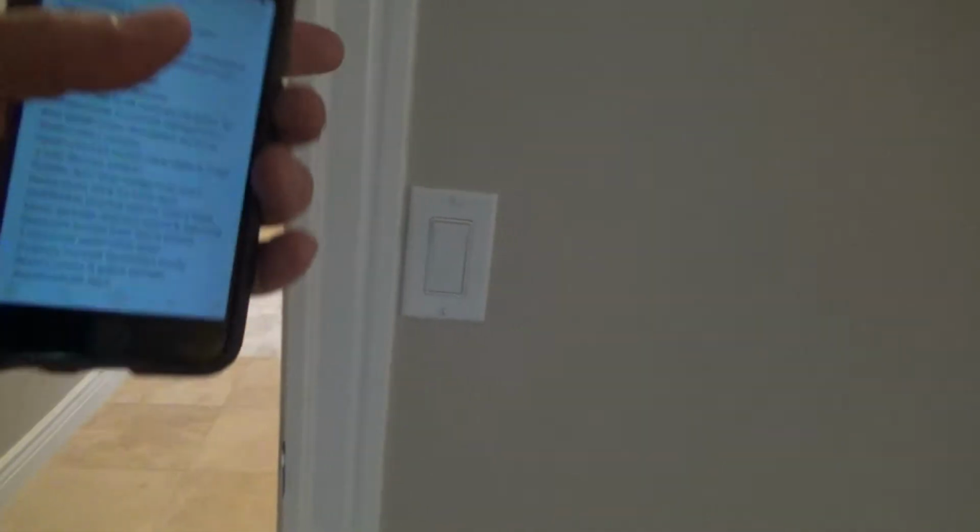Cut it. I take out the light switch, cut out, put a 2-gang light switch in there, put this switch back in there, and I'll probably relocate that over here, and I'll have the switch closest to the door for the new ceiling fan. And so once I cut that out, then I'll be able to fish a wire from there up the wall, drill a hole up in there, and I'll use a flexi bit.